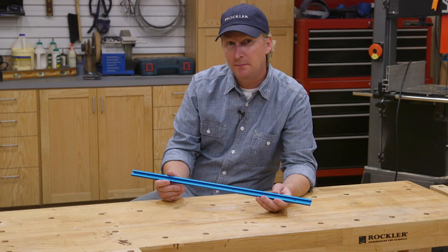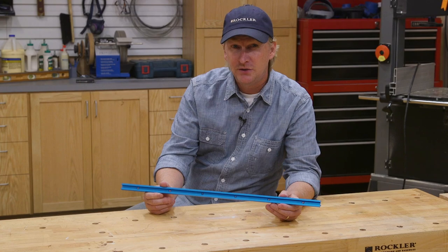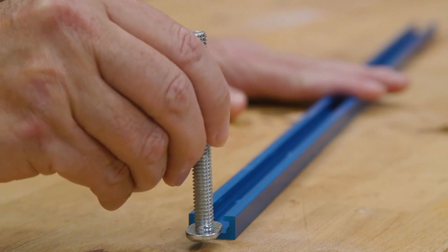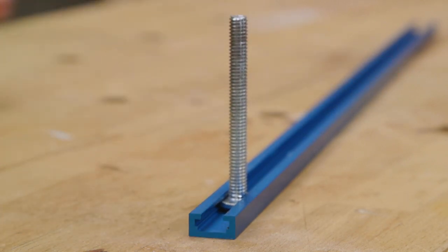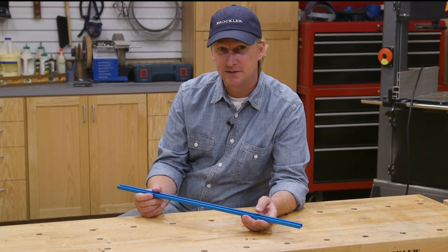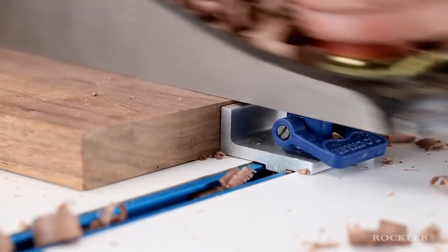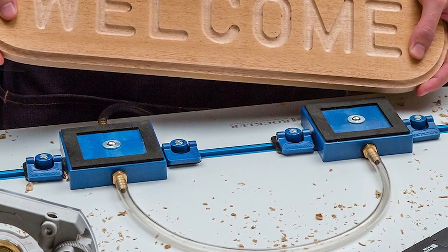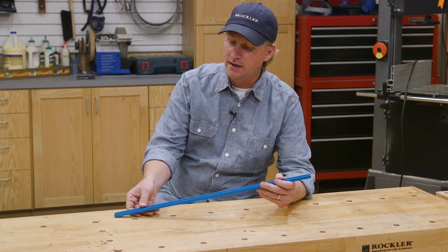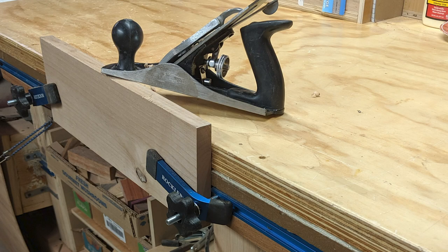Another cool option to add more clamping and secure accessories to your bench is to add this aluminum T-Track. It's three-quarters of an inch wide by three-eighths inch deep, and as the name suggests, features a T-shaped channel that accepts just about anything attached to a five-sixteenths or quarter-inch T-bolt. You can make your own fixtures to fit in the T-Track, or choose from Rockler's wide range of accessories, such as hold-down clamps, straight-line clamps, stops, and even vacuum pods. Installing T-Track in your bench is as simple as routing a three-quarter inch wide by three-eighths inch deep channel in the top or in the face of your bench.